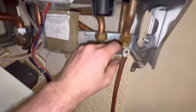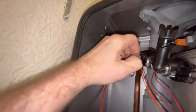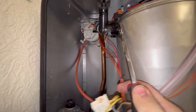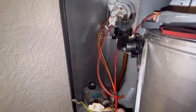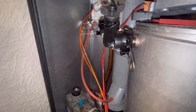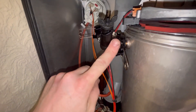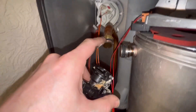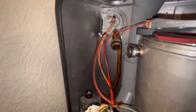With the system bunged, we're going to drain it off. There's a drain point on the water side - use the bleed key and you'll see a little bit of water come out. Now the pin will come out and you should be able to pull the flow elbow off. These can be a bit tight so get a flathead behind it and prise it out. Close that drain point to keep the vacuum. Twist the flow elbow and keep moving it to loosen up the O-rings, then pull it off. There are two O-rings on there.